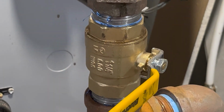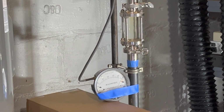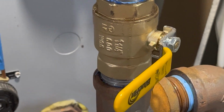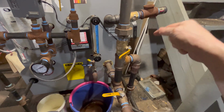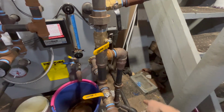Now surely, with the equalizer closed, we don't see any water rising in the sight glass. How could that be, right? The equalizer is supposed to be equalizing. The equalizer is supposed to be somehow equalizing the pressure here in the near boiler area, now sitting at 2.25 psi, to keep that pressure from pushing on the return water, right? That's what's supposed to be happening, but